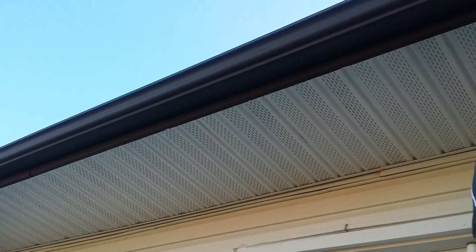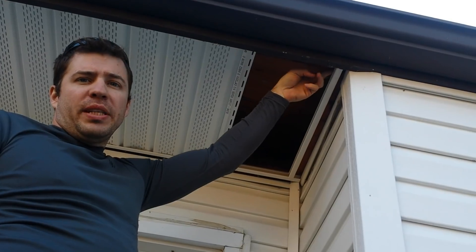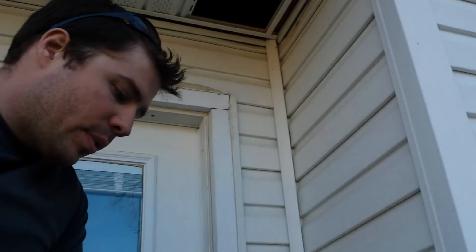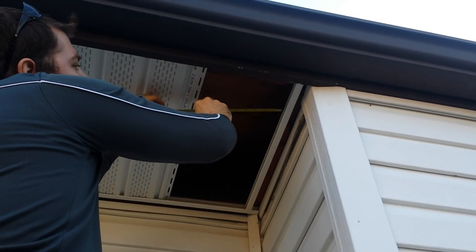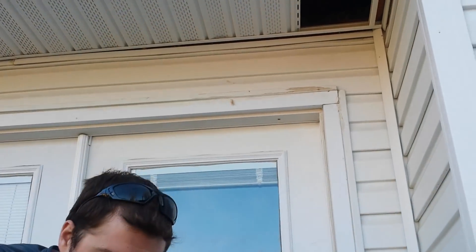Okay everybody, we're almost done. When you get to the end here, I took a piece of F-channel and ran it like that - I cut it to go up under the trim. Let me show you: I cut the trim here and then it went under. Same thing over there. This last piece is a full piece but I'm going to have to cut it off and slip it up in there. Measure inside your F-channel sleeve and also to the lip of the other one because that's your needed distance. Mine says 11 and a quarter inches, so that's what I'll cut it.